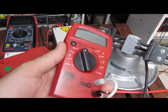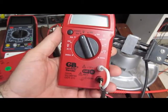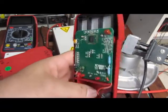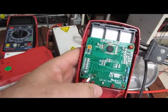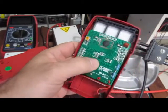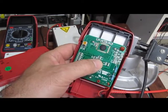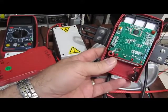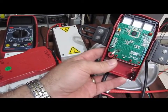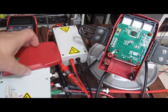This is another meter a friend of mine gave me — this is the Gardner Bender, model GDT311. Again, it died at 2 kV, 50 ohm. Let's just see what this does now. This meter, I think, could actually have been repaired. There's one resistor — it's this one here at the tip of my thumb — that looks like it blew a hole through it. So it probably could have been repaired; the IC seemed fine with it, but it probably won't be able to be repaired after this.